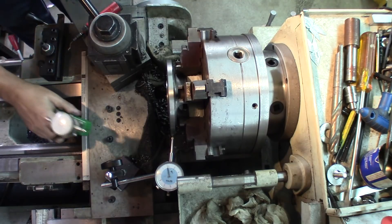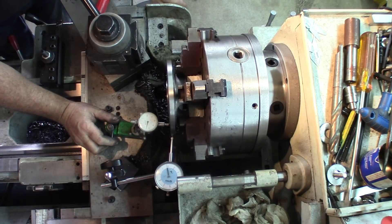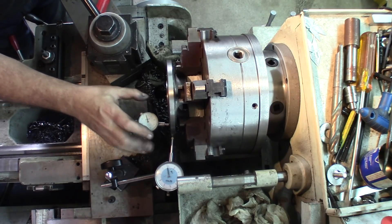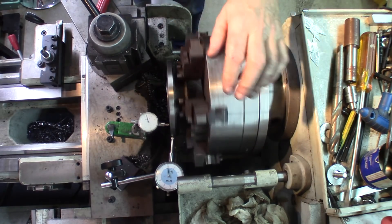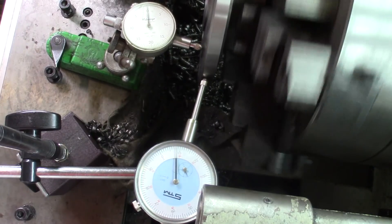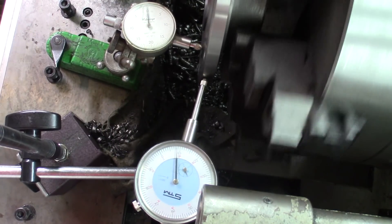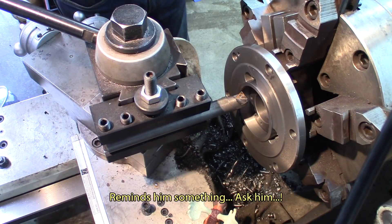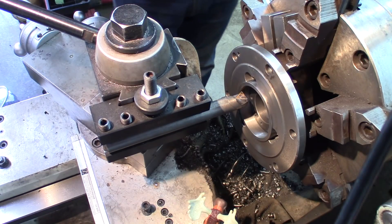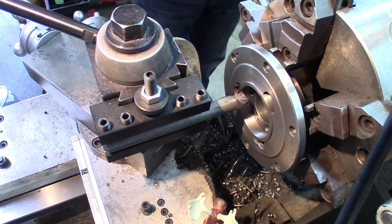And the ultimate check here — load this, make sure it's stable. Those two needles have got to be pretty steady. Now I'm ready to machine. I think we're within very reasonable tolerances. And it's mighty important when you do setups like that and you use parallels — when you start your lathe, you're just about half dead, so think of taking them out before you do any work. This could kill you.